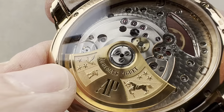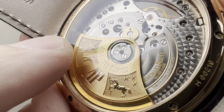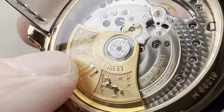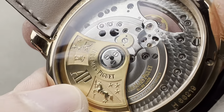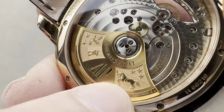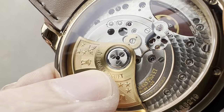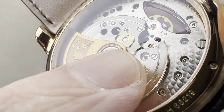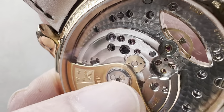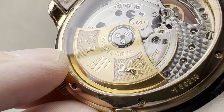On the reverse side, you can see the rotor with the coats of arms of the Audemars and Piguet families, reminding you that this company is the oldest Swiss watch brand continuously owned and run by the founding families. All this pivots on 34 jewels. You can see the regulator from the underside, and several different finishes on the rotor. On the bridges and plates, we have circular côtes de Genève on the winding bridge, black polished screws — mirror polished on their heads — engine-turned perlage, and primarily machine-finished beveling on the edges of the bridges, but it's handsome and worthwhile.